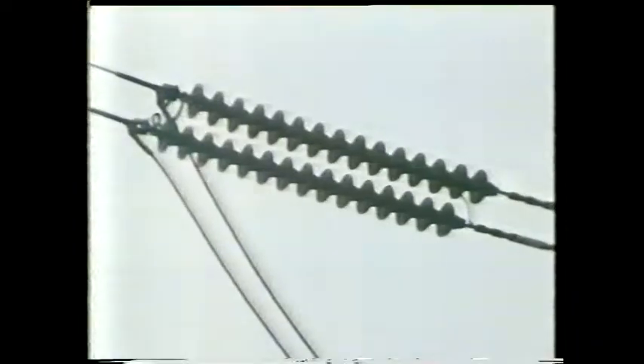Let's repeat the experiment but this time we'll put a rectangular strip of perspex in the gap. Watch the surface of the perspex — that was where the air first became conducting, and it happened at 150 kilovolts, lower than before. Because of this, high voltage insulators are usually shaped in a special way. The shape is designed to increase the distance over the surface of the insulator from one end to the other, reducing the risk of air in contact with the insulator becoming conducting. On overhead transmission lines a whole chain of specially shaped insulators are joined together, giving a zigzag surface path.